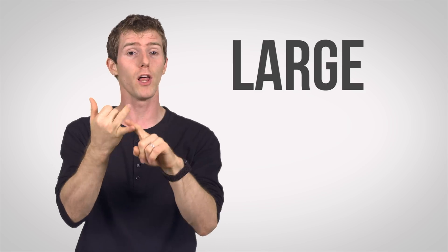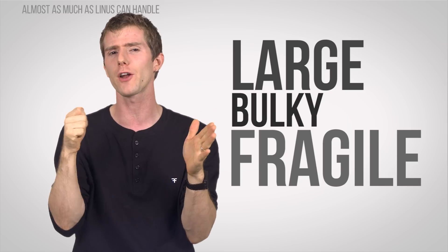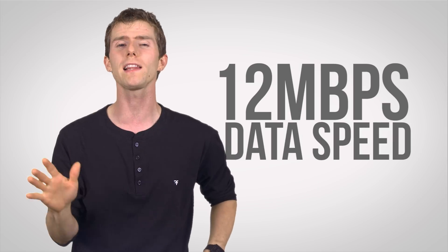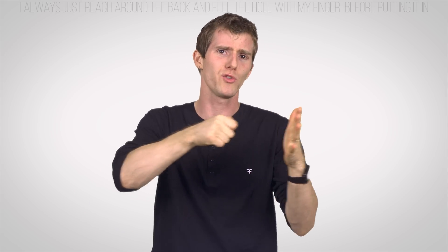Back to the original standards — I don't want to hate on them or anything. They did propel the universal serial bus to damn near ubiquity in the computing world, but they had some fairly significant limitations. They were large, bulky, and fragile, rated at a mere 1,500 insertion cycles. They were only designed to deliver a little bit of power. The speeds at which they operated quickly became a bottleneck. And particularly irritating on the A connector, they only went in one way without any clear visual indication of which way was right — leading to the joke: how many tries does it take to get a plug into a USB connection? Four: twice to get it wrong, once to think you got it wrong, and one more time to put the damn thing in so you can hear that ever-so-satisfying doo-doo.